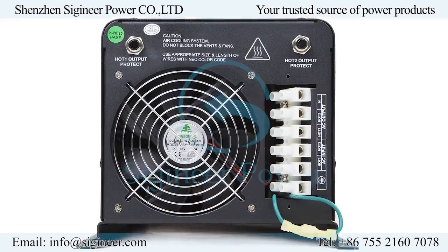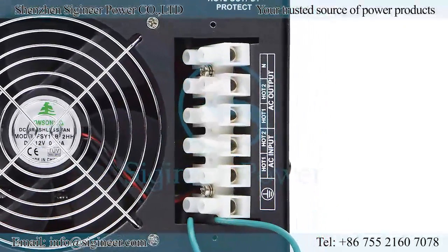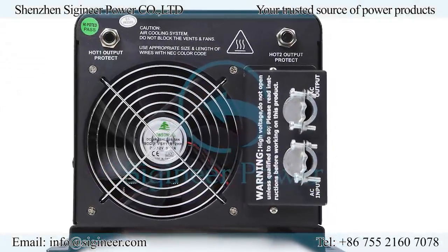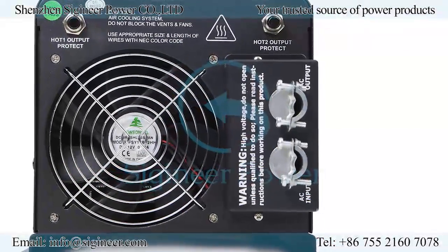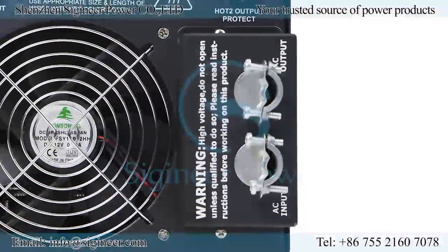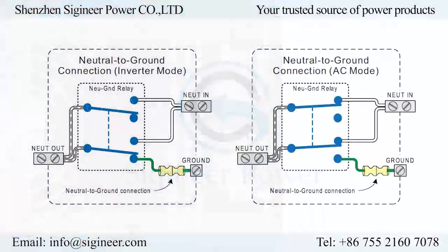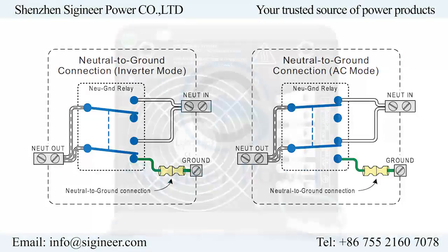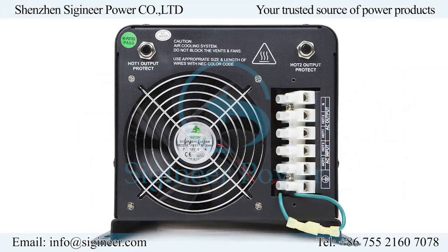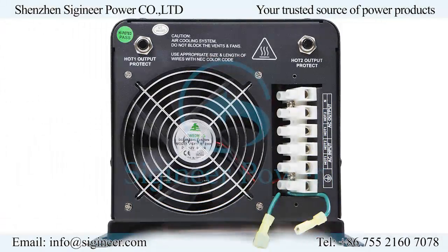There are two DC terminals, one red and one black. With the AC direct connect terminal block, you can hardwire your AC input and output. This inverter charger features an AC wiring compartment with two strain relief connectors to access the AC input and output terminal block. This inverter can also be built with an optional automatic neutral to ground connection in the factory, but this connection can be defeated by separating the insulated connectors on the green wire near the AC terminal block, so it will not bond the neutral in any mode of operation.